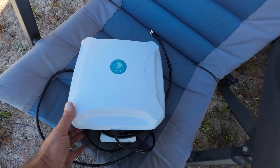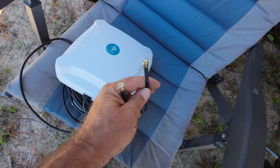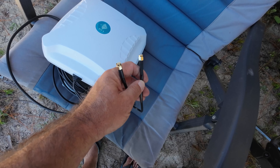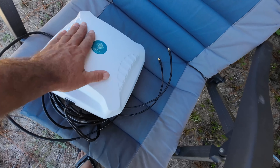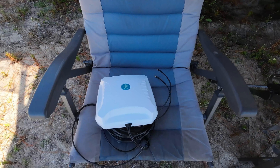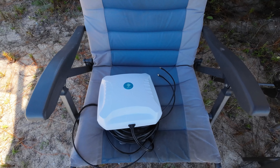This is our panel antenna that we normally put on our pole — our 10 metre extension pole. As you can see it has got 2 connectors, because it essentially has 2 antennas in it. The new system we're putting up has 4 connectors and 4 cables, because it has 4 antennas, so you can get a lot more data transfer a lot quicker and a lot more reliably. Having 4 antennas normally makes it perform better, and you can ignore some of those data losses.